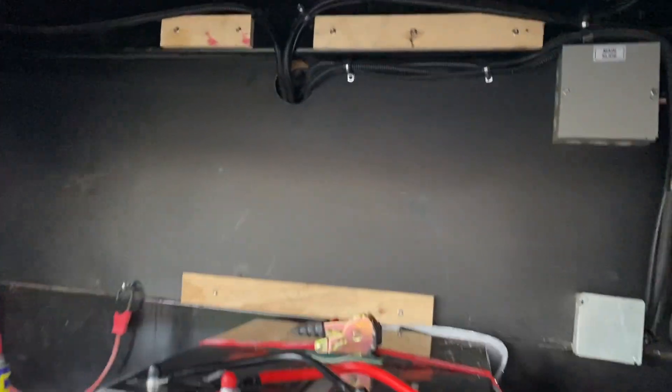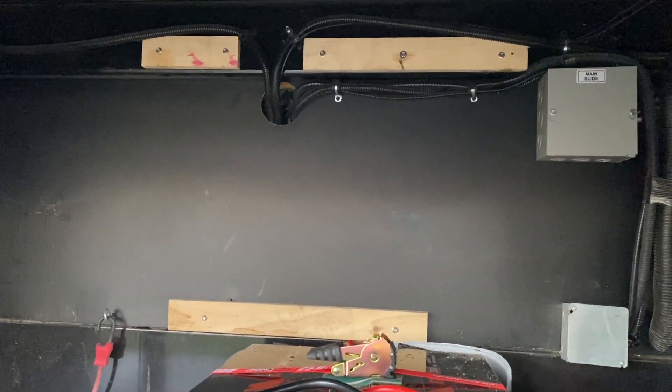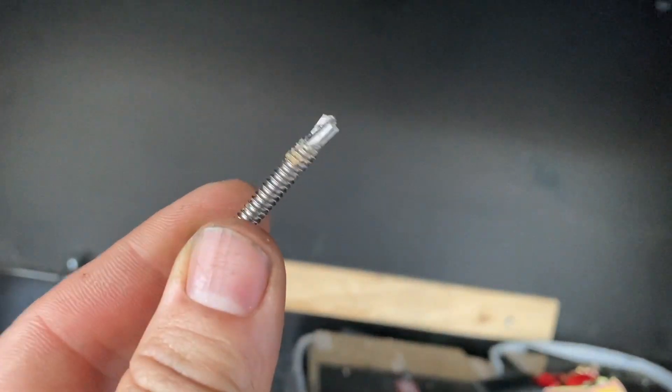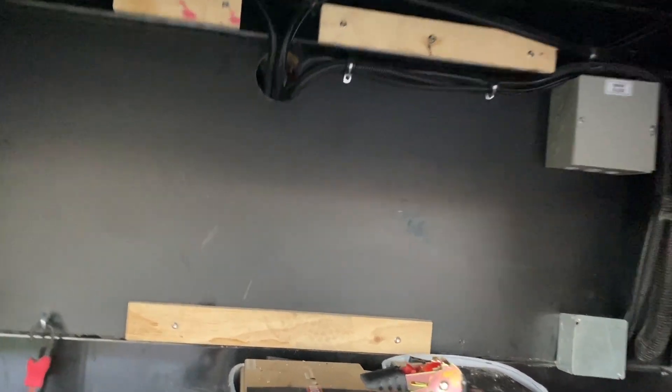We are about to put the board in there. What I did was put some three-quarter inch plywood backers up there so it's a little bit easier to screw into. I used self-tapping screws to secure those up there, and then those are a little bit easier to hit and it spaces things out. We can make those runs a little bit easier. AC lines will come up through here — I may have to pull some of these out to snake those around.